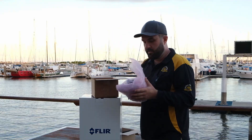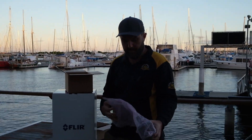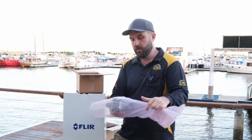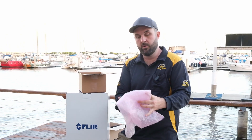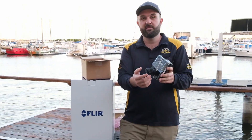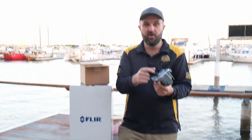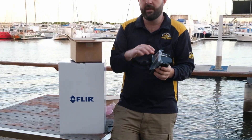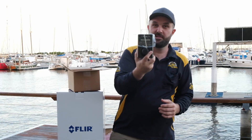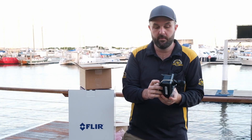In the JCU box we have the JCU with lots of bubble wrap. It is the control unit for the FLIR. FLIR is now directly plugged into your navigation units on your boat, so you can control it off the navigation units, and you can run as many of these control units as you want. It's like a CCTV system — basically like a security guard in a back room with a knob to move the camera around. This powers the unit up, allows you to change settings, zoom in and out, and move it all around. The camera will rotate 360 degrees on its axis and also pan and tilt 90 degrees. The JCU uses just one cable — an ethernet cable, the same cable you plug into your computer at home — and it also gets its power off that cable, so it's nice and neat.